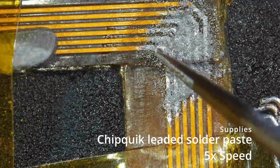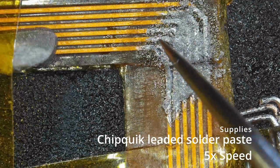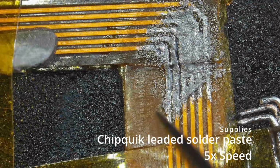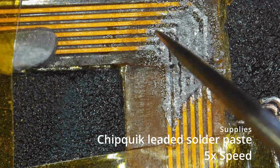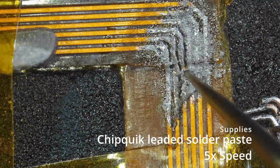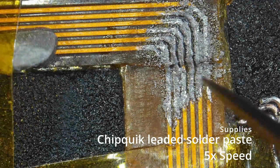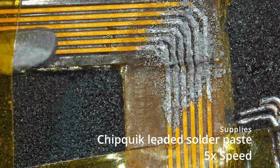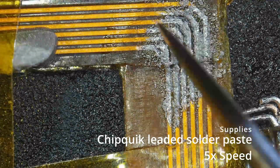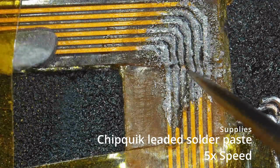So I would skip this step entirely. Just a good pre-tinning, get ready. Lay your wires down. I would probably still use the flux paste to hold everything down as I'm doing the repair, but I would give it a chance, whereas I didn't in this process. So I jumped to another option right away. And it could have worked. It didn't, or it didn't exactly according to plan. It might have contributed to the success of it, but yeah, it was very time consuming. So I wouldn't recommend it again. And if you don't have solder paste, then just rely on your tinning from the first step.